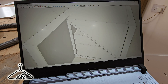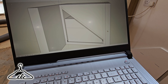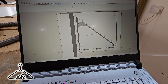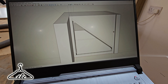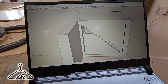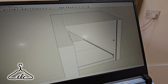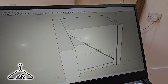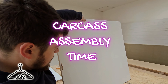Let's have a look at the profile — really beefy. The steel is thicker. Everything is bigger about these than the standard 45-height runners. The rebate is going to accept the bottom of the drawer. Six mil is absolutely fine. We're going to glue and pump in loads of pins and 30 mil screws, so it's not going anywhere. It's not carrying heavy stuff — just shoes.